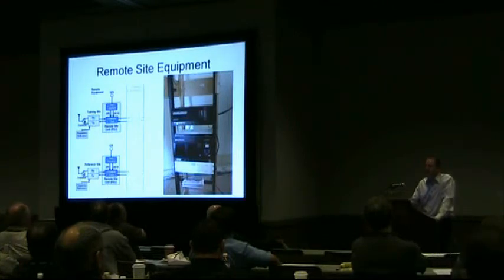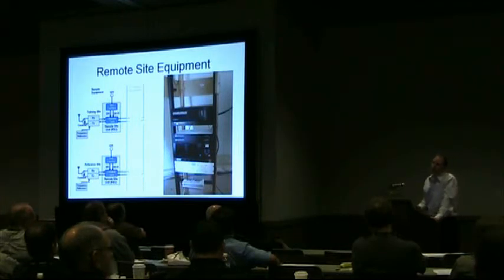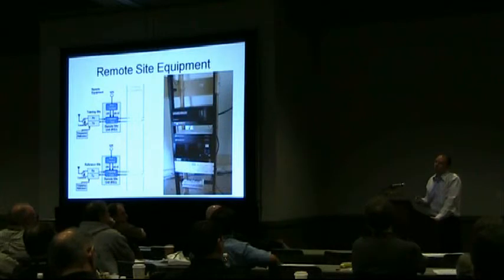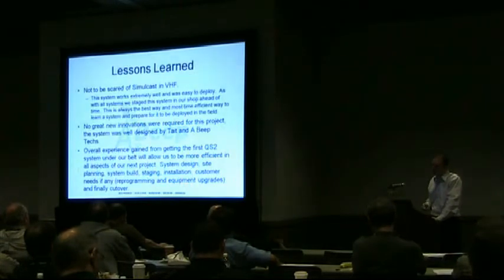All of our sites have Ethernet that rides on the side of those T1s with the Exalt running, so we can actually remotely program and go through all kinds of diagnostics on the Tait base station. When we first put the system up and we're testing, we had an officer who was complaining of coverage in an area. From the shop, our guys could remotely log into that base station and measure the signal quality of its incoming signal strength, and have somebody else go to the same area with another portable or mobile, and that's huge. It just saves you a lot of time, windshield time, things like that.